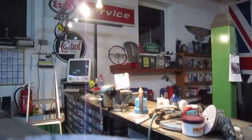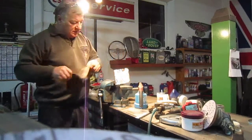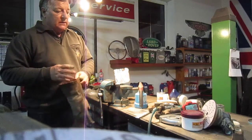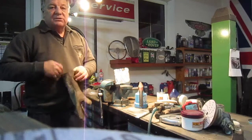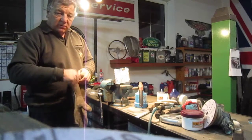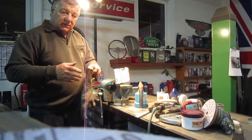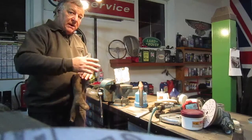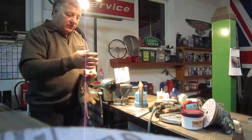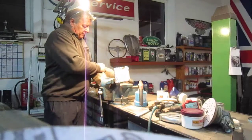And I'll bring the thick piece over. So what I was saying about this is it's better to use more lead than you need. So if you're getting up with a really big bump, no problem, because you can always cut it back. But if you get it too low, then you have to start all over again. So that means you have to reheat the lead that's in, and it's going to run, so all that work you've done is not enough. It's better to put more on and shave it back, and not put not enough in and have to go back on top, because you can't just blob it on top. It has to be a molten lead with the rest of the lead, or it won't hold.